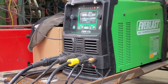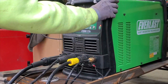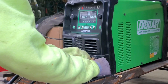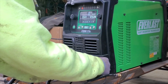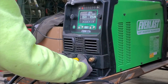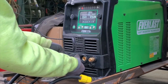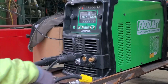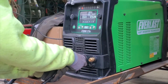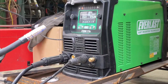And then here, in real time, we're switching over from plasma cutting to MIG welding. You can see the MIG gun is still installed on the left — it stays installed. On plasma, you have electrode negative, so your plasma torch plugs into the negative. In order to MIG weld, we need to move the ground clamp from the positive to the negative and unplug the plasma torch from the negative port. It's a fairly simple, safe, and fast operation — about 30 to 35 seconds and you're ready to go.